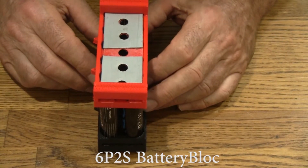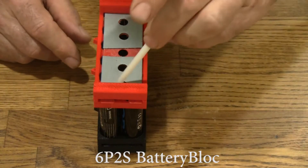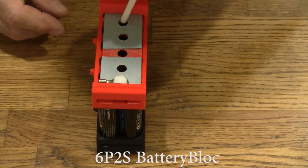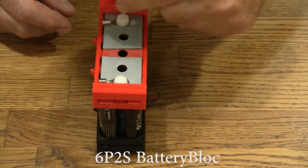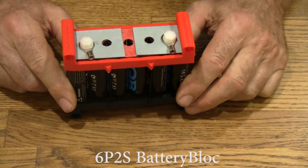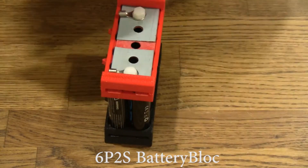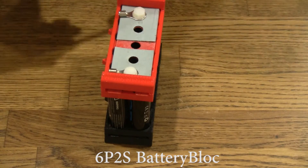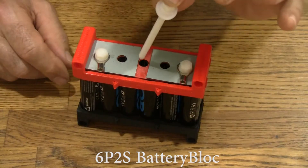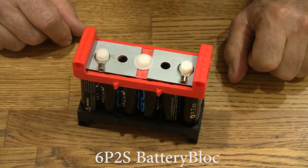Let's put some bolts in it. We know this side is a power side and this side is a power side — one's positive and one's negative. We'll put those two in. They've got ring terminals on them; these are 10 to 12 gauge ring terminals and they come with all battery blocks. The center here has a gap and this bolt goes right through the gap. This gap is important, and this nylon bolt is important, because if these two plates were to touch they would short. The nylon assures that they will not.